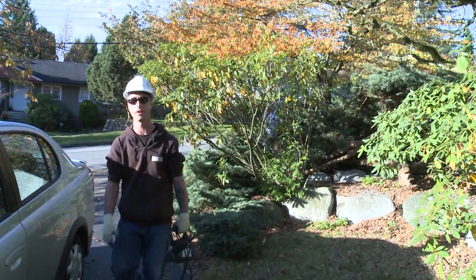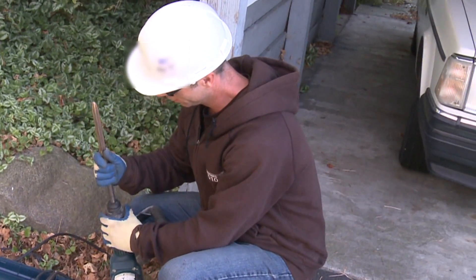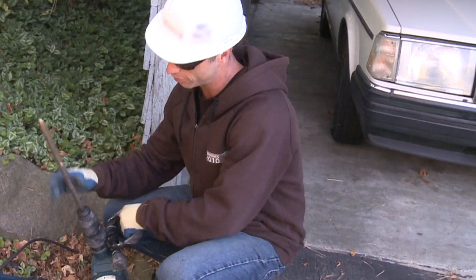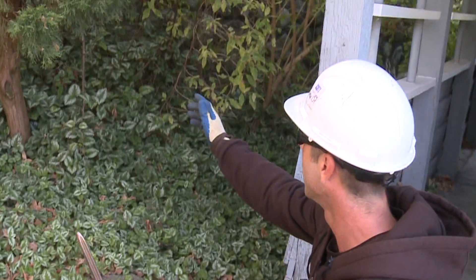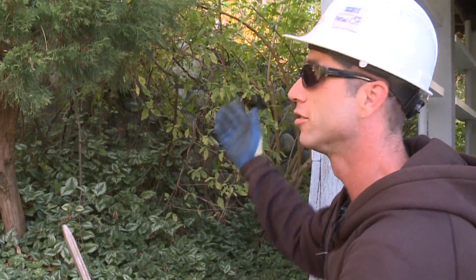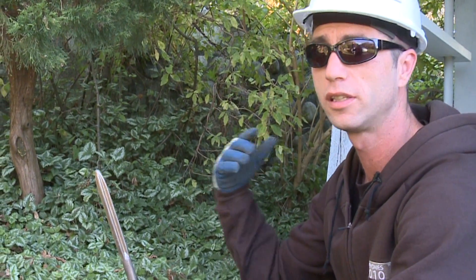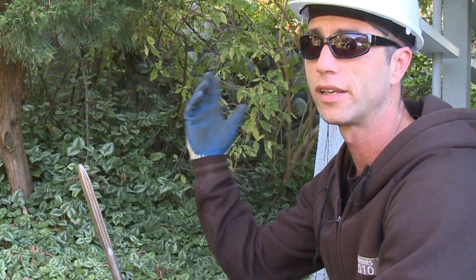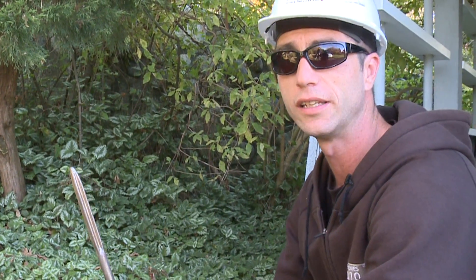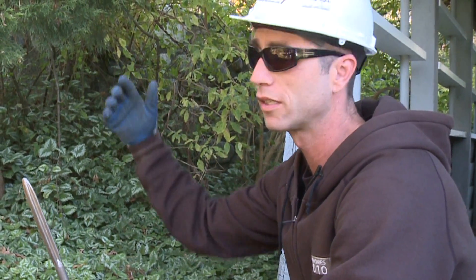I'm Sean and I'm here to jackhammer a bunch of holes in the wall. I'm putting on the spike that I'm going to be punching through with the mortar, and I'm going to be perforating the wall in sections — from about halfway down to the end — so that they can pull over the wall in cleaner sections instead of creating a big mound of debris, so they can haul it away more cleanly. Then they're going to be backfilling towards the rest of the wall.